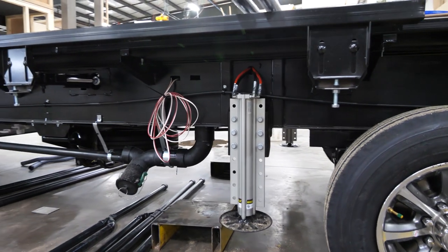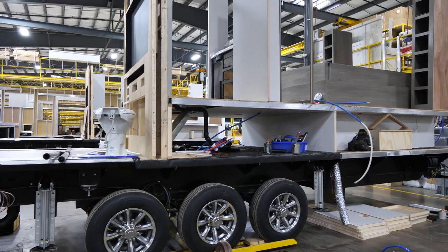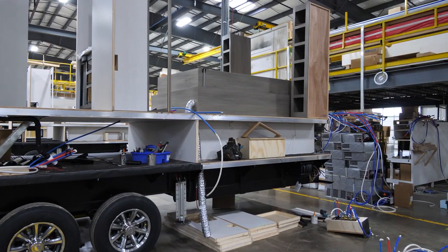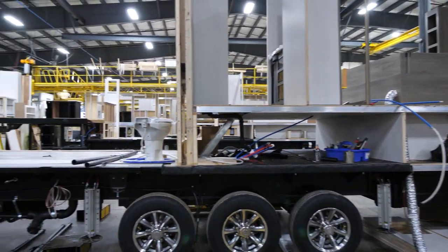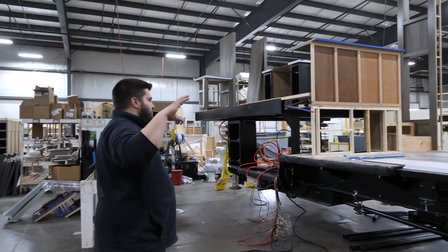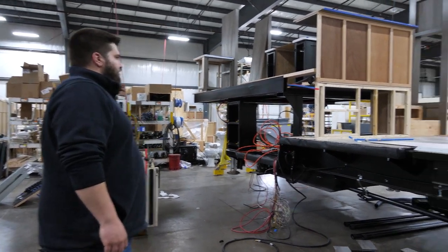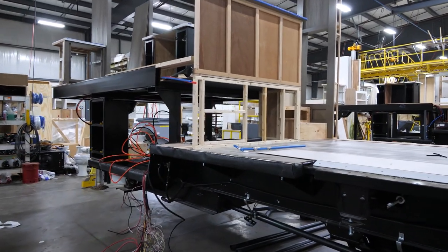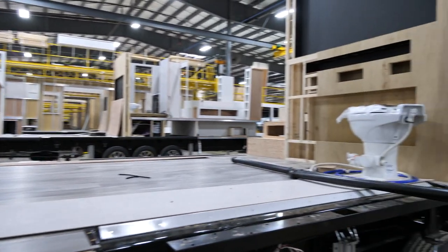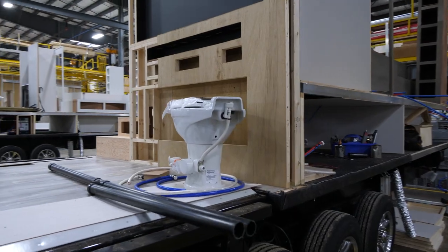You're starting to see some plumbing out because we're near the plumbing mezzanine. We have a mezzanine where all your plumbing — same as the cabinet shop — is cut with lists a day or two ahead of production. You'll see appliances prepped from heaters to actual plumbing being installed in this area, so by the time we move through, all your plumbing is in. We use Toughpex plumbing, which is rated to negative 28 degrees with water in it before it'll crack — it can actually expand two to three times its size before cracking.